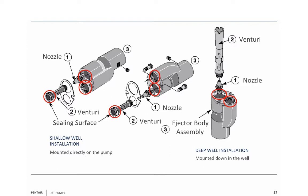If you look at the end of the venturi tubes on the shallow well jets, they're round. They have to be totally round because we use that venturi tube to butt up against the diffuser ring, which separates the suction side from the discharge side of the pump — they're used as part of a seal. If you look at the venturi tube on the deep well jet, you can see a set of little cutouts, and we use those to tighten the jet up with an air tool to a certain torque.